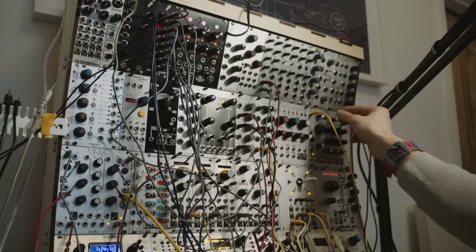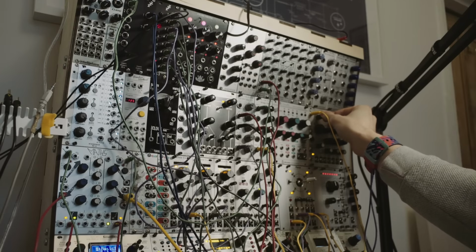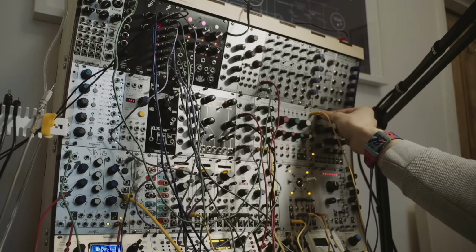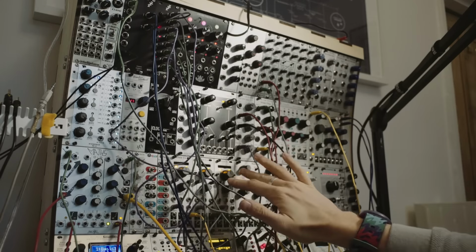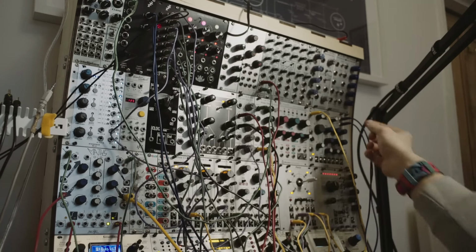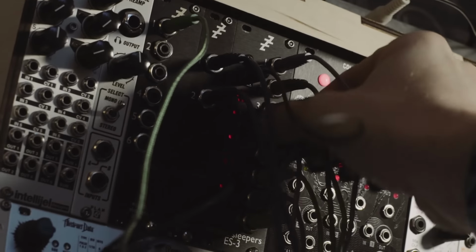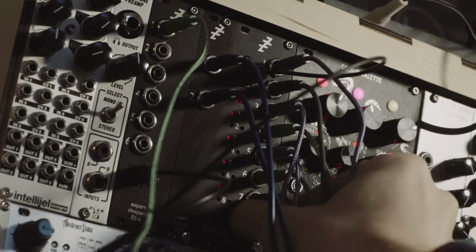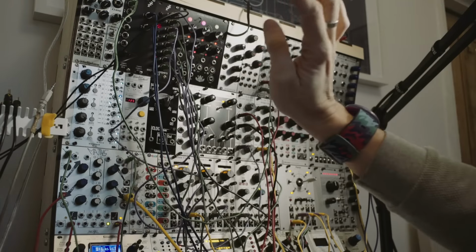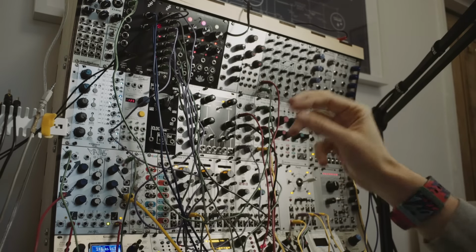So, for its next trick, polyphonic CV generation. Should you be blessed with a multitude of oscillators, filters, envelope generators, and VCAs, a Silent Way and ES3 combo with a computer can spit out multiple channels of CV designed to turn a modular into a huge polysynth. Badass. Of course, it's not for the faint of heart.